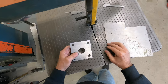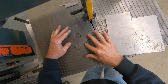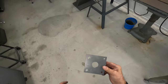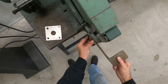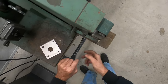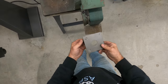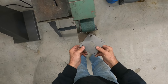I just keep a thin cutoff wheel in there and press a little less hard. I could have cut it and knocked those corners off, but I want to show you how I deal with making these corners nice and even looking. On the disc sander I want to cut the flats first at a 45, all the flats.